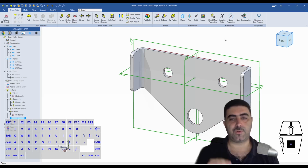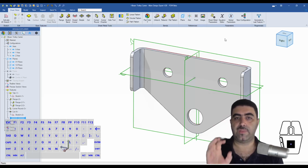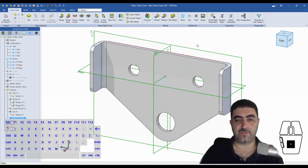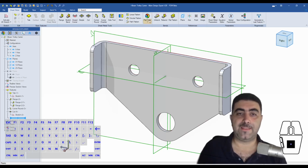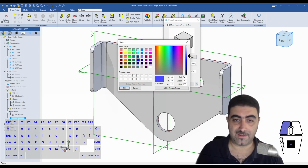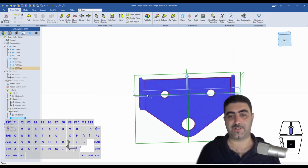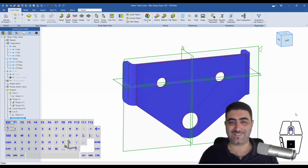So I guess this episode was a good example of how you can lay out something with reference geometry to make sure that it assembles correctly. And it was also a good explanation of how to create sheet metal parts that are strong without necessarily being extremely thick. And as always, let's give this a color that will stand out and can guide our eyes as we're assembling it. So that's a nice part. I think we did well today.